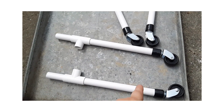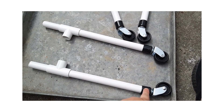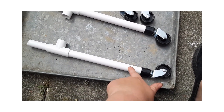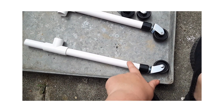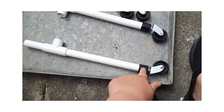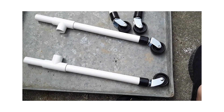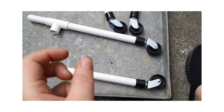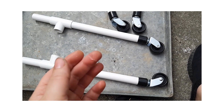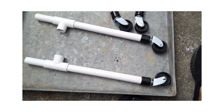So that stage is done, relatively easy. The caps are 22mm inside, so slightly too big for this waste pipe. So I just put a bit of silicone sealant in it, and when that sets up it'll be fine. It won't stick it but it will hold it in place and make it firm. I've got silicone sealant on my hand.